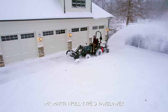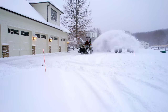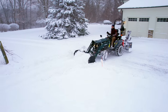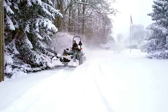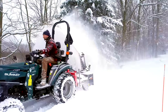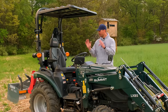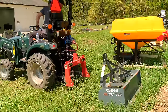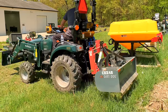Staying on the three-point hitch — it does have turnbuckles on there for the sway arms. They're threaded rods: you screw in and screw out instead of a telescoping version. I believe Summit is working on a product improvement to come out with a telescoping version, and if they do, I would imagine it'll be retrofittable. That said, on the 1025R, the 2038, even the 3E series — it's found on a lot of tractors. I just don't like it; it's kind of annoying. When I have a quick hitch on, it doesn't really matter because everything is locked in place anyway. It's just when I take the quick hitch off and put on a flail mower or a post hole digger, where you have to adjust those lower arms to hook things up and then retighten them back down — that's when it's annoying.